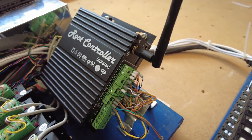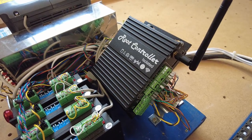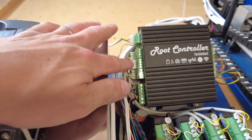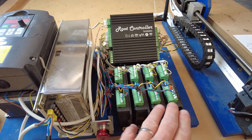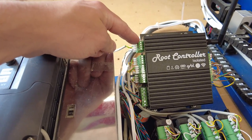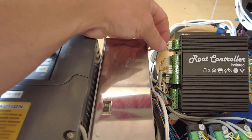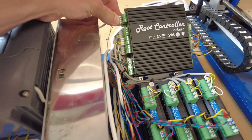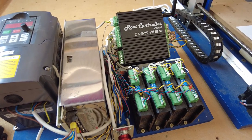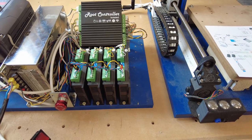Quick overview of the actual connectors: as you can see, these are inputs down here. Power comes in through this connector for the isolated zone and then isolates its own internal power rails. From there we've got some relays down this side, and on this side are our stepper motor outputs. Isolation is achieved through these particular drivers - they've got opto-isolators on their inputs. These are non-isolated outputs, but we've got an isolated RS-485 that is powered via the VFD. I've got the laser port just behind it, and the MOSFET areas down the bottom here.